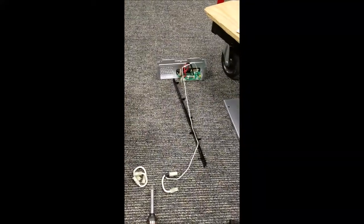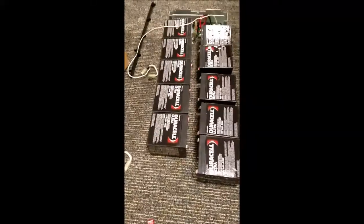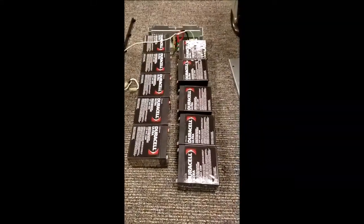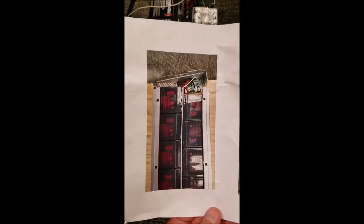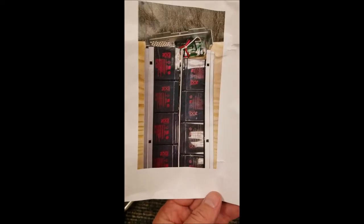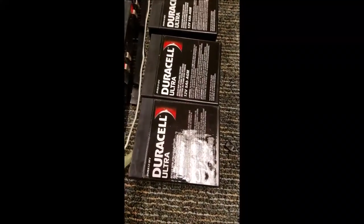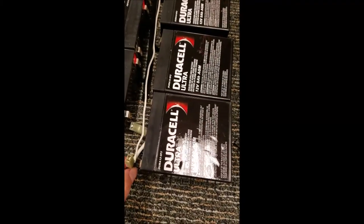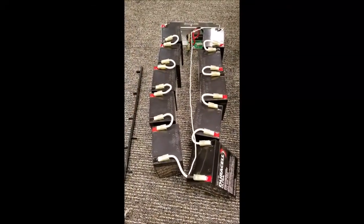We're just going to line these all up and slide them in. We've got all the batteries out and lined up like they were before. To make sure I always get the wiring correct, I printed out a wiring diagram — I usually leave it with the spare parts. The main thing to look at is where this little lead here goes — it comes all the way down through here and hooks up down here, so it's important to make sure that's wired in correctly.